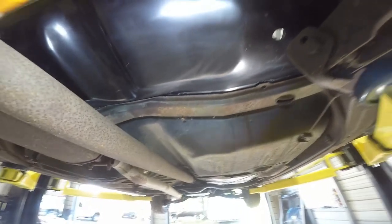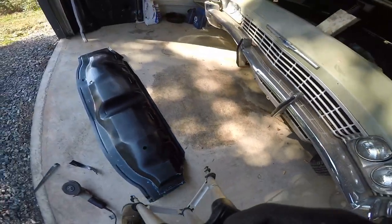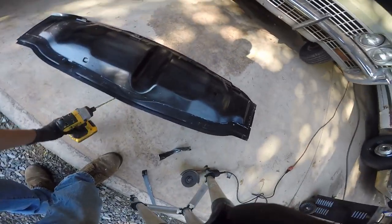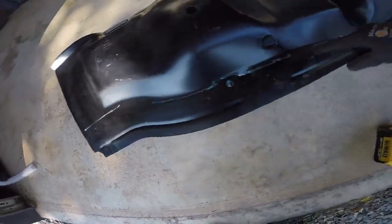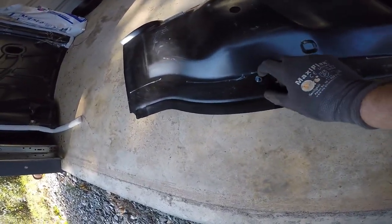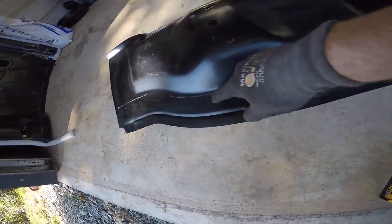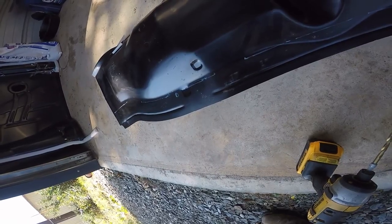Finally I'm starting to fit my rear seat pan. It's not gonna be a lot of fitting - I've got everything cut out - so it looks like it's gonna lay down there pretty good. I marked this pan right here, you can see the white mark across here, and this is where the metal brace underneath is going. So I came in and drilled some holes in that so I can spot weld the pan to that brace.